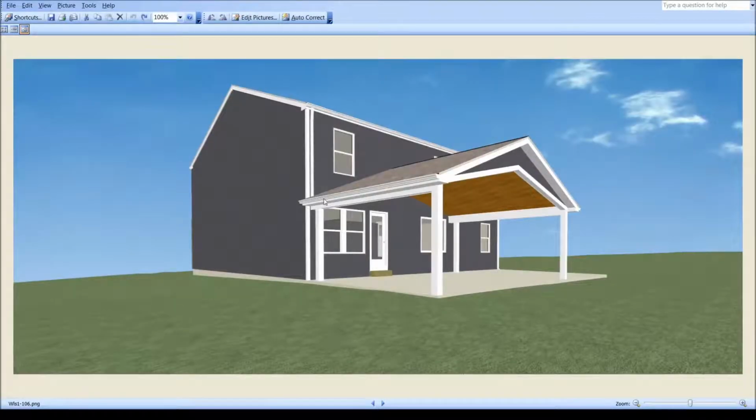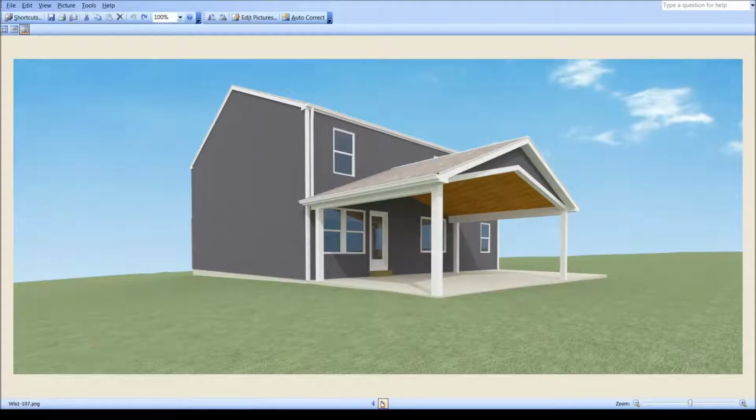First of all, these columns back here, I originally had them about 10 inches out from the wall. I've moved them back, where there's about a 4.5-inch gap. Anything larger and someone might get caught back there, but I wanted to push them back that way so that their little concrete pedestals can just run up against the foundation.